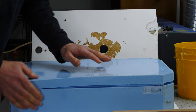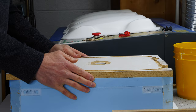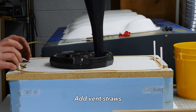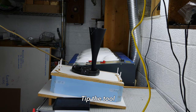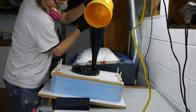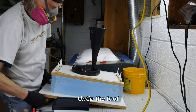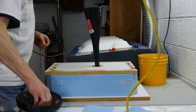Let's reassemble the mold — it goes back together quite easily. You can see where that key seal is super handy: it aligns and seals the mold. I place a board on top that has some holes for my vents and my sprue, and I add a weight just to keep everything together and resist the pressure of the resin. We'll add some straws for the vent areas because we're going to tip the tool, and this allows the resin to flow into the straws and not all over the mold, keeping things nice and clean. Let's slowly pour the resin into the funnel in the pour hole. I use a vibration tool to vibrate the bubbles out of the resin while I pour to minimize bubbles in my part. I'm going to un-tip the tool after a few minutes when the resin has flowed everywhere, and we just let it cure. Time to demold and take out our part — twist out the funnel, take the mold apart, and we'll have a good part.